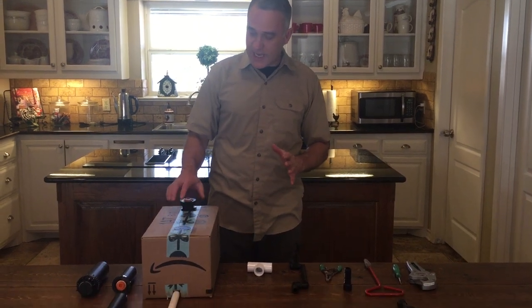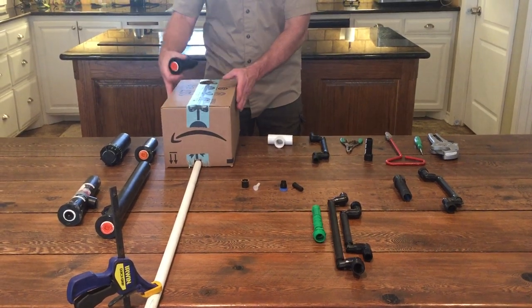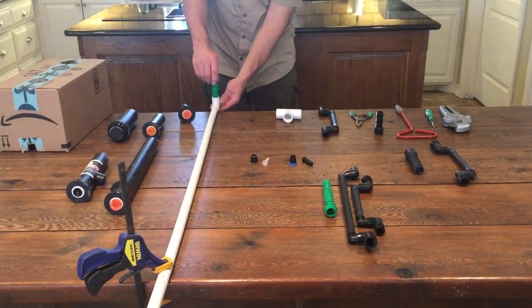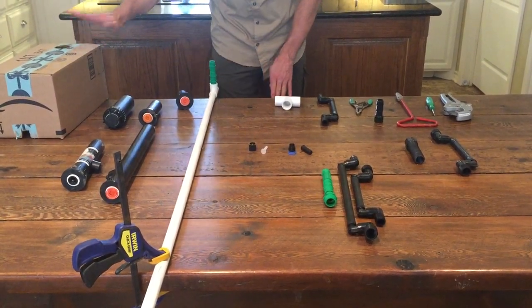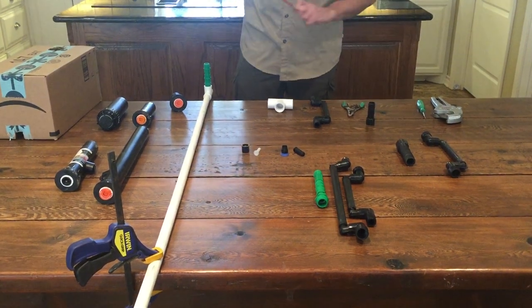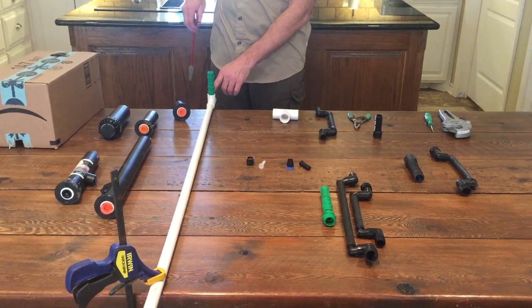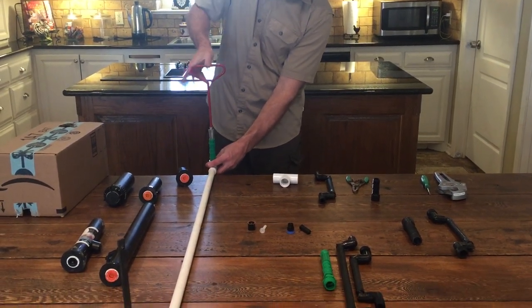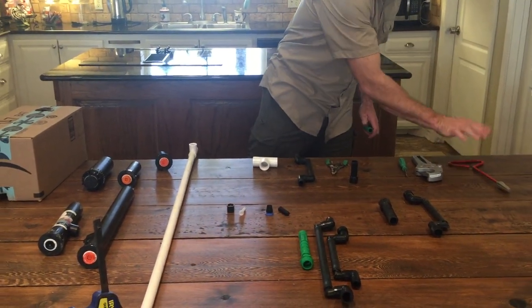In this scenario, let's say this head is broken. The first thing you're going to have to do before anything is dig it out so you can see what you're dealing with. Here we can see an extension riser or nipple still in place. If it's broken off, you could use needle nose pliers — that's probably 15 to 20 minutes — or you can get one of these tools called an extractor. You just stick it in, turn it, and it makes your life so much easier. That's the first tip: get an extractor if you want to do this maintenance yourself.